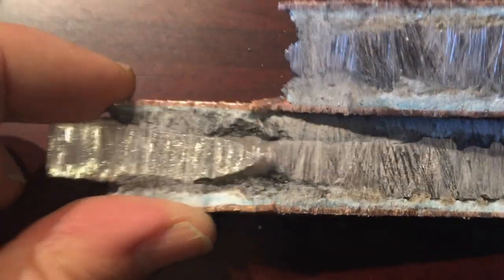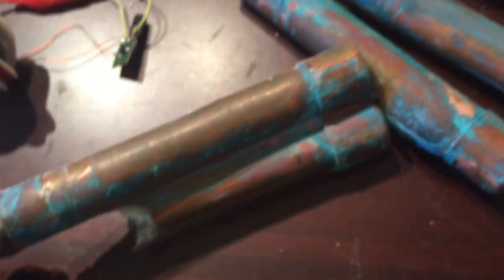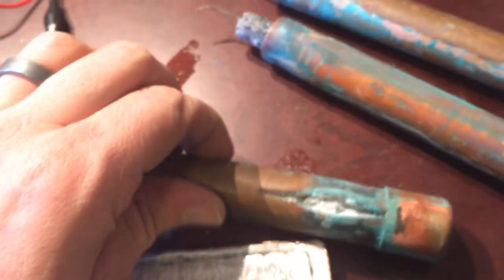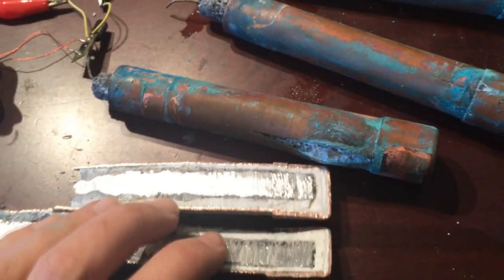This is the edge of the magnesium rod right there, but there's just a ton of magnesium left. After running three and a half years and having that much good-quality magnesium down through the core, this thing would have run on and on for many more years. This one is blowing out the side, but the other two look fine — I may put them on the shelf or even put them into another project.